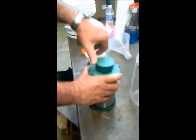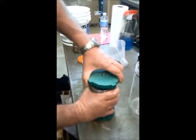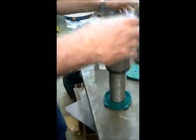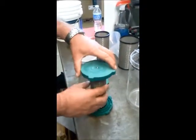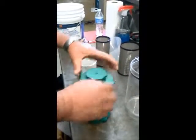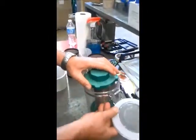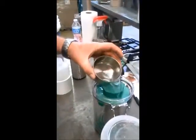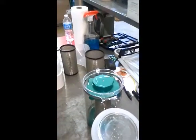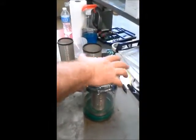I'm going to open up and remove the outer and second screen — the 200 and 170 screen — from the pack. I'll put the cap back on and seal the system. We're going to determine the next level of particulate size in the sand, going back to earlier steps in the test where two cups of water will be added. The spec check will be sealed up and agitated for two to two and a half minutes.